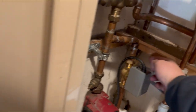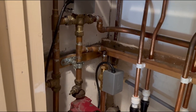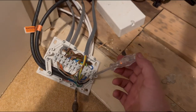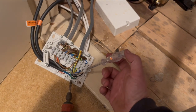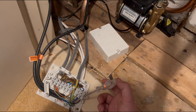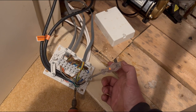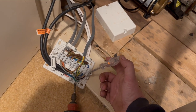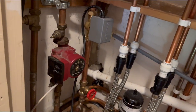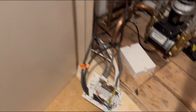Could you turn them off please? Once that happens, all this should go dead and we'll hear that zone valve close. There we go — the underfloor's gone off, zone valve's closed. Sorry if this is a boring video but I thought it might help some people out, because I know a lot of electricians are a bit scared of heating. But it's just a series of switches once you learn it.